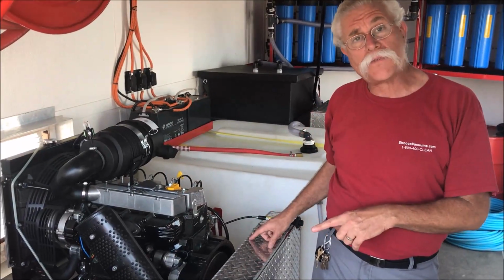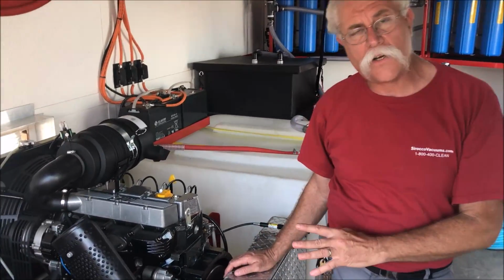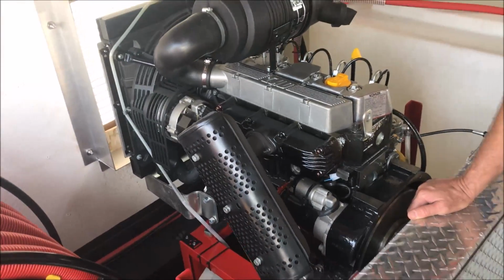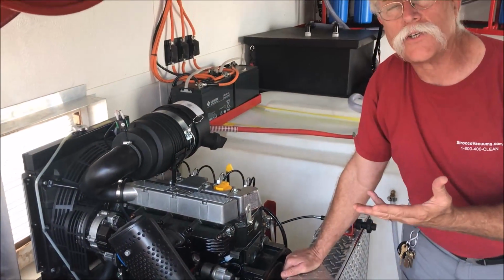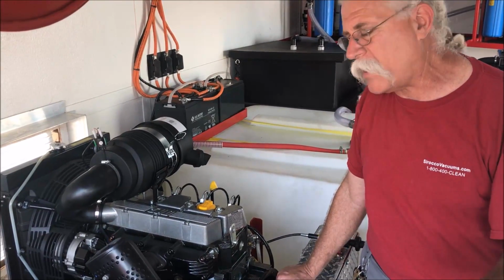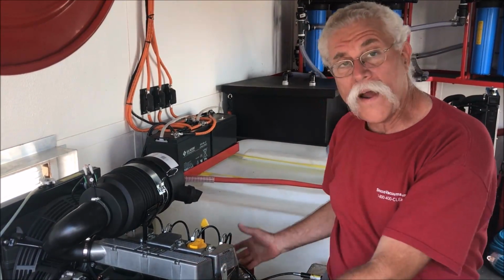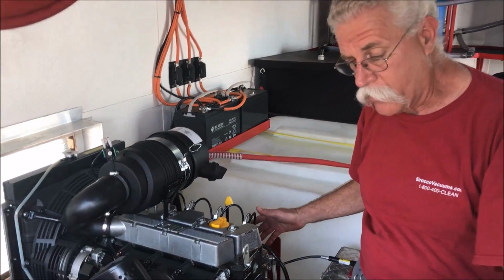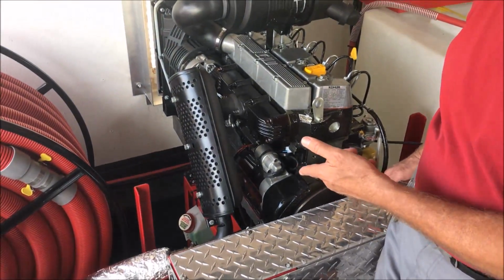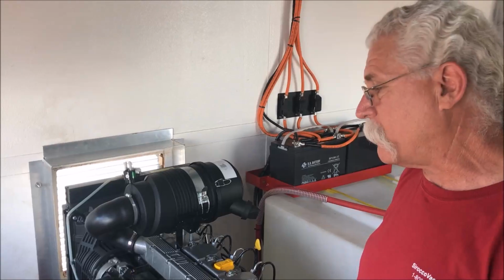So moving right along, the pressure washer up inside here is a 2.2 liter Kohler KDW series engine with dual pumps underneath. We have the pumps on swing arms, so they're very easy to do belt tensioning, but the only thing we actually have on the pumps are the pressure relief valves. We've moved the pressure regulators for these systems out to the heaters. So over on the heaters, I'll show you in just a minute. The pressure regulators are more easily accessible, and they're away from making you stand on your head when you want to service something. So when you want to tighten the belts on this system, it's a 10-minute adjustment with the swing arms, and there's really nothing else to do on the pump systems but maintain the pumps themselves.